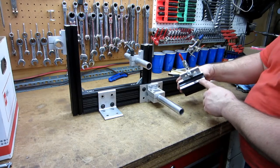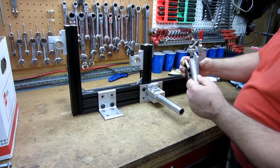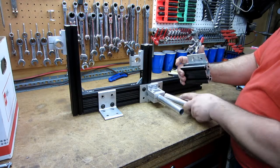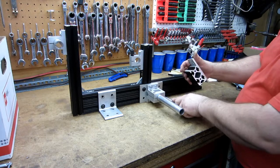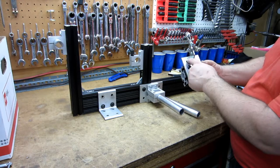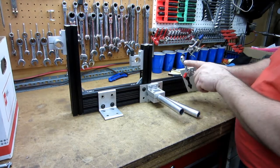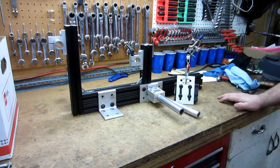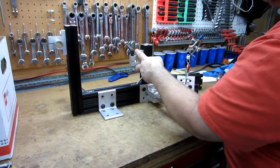About the only thing we machined here was the top of this, to make a V for the tube to sit in. You could actually hacksaw that off and file it down, because the accuracy is in the sidewalls of the V. These don't actually need to be slotted — we just didn't think to measure and position the screws ahead of time. We could have just used a longer screw here too, so everything's adjustable.